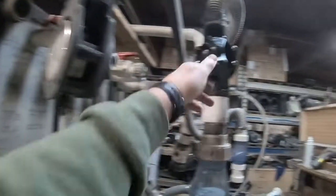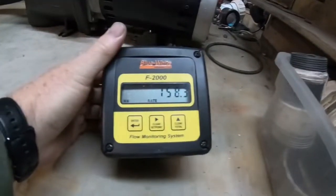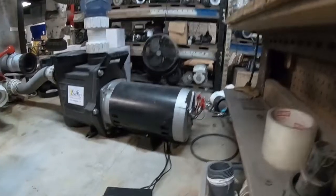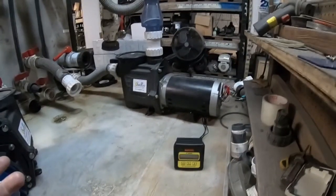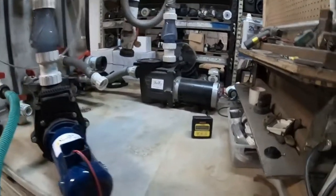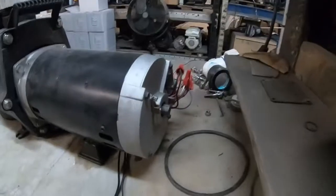The AC pump is going to work hand in hand — so I'm going to open it all up. Solar pump's going all the way. We're at 100, almost 160 gallons a minute, but now it's going to start going down because the AC pump is no longer needed and costing you money on your utility bill, since the DC solar pump can cover the flow rate needed for that water feature. Now we're going to see the AC pump stop.